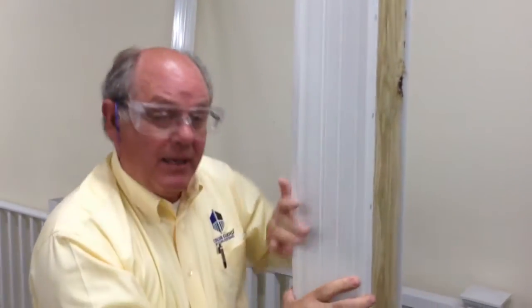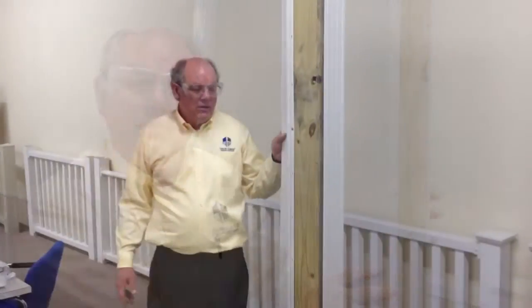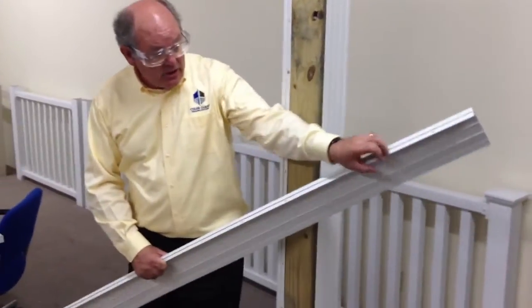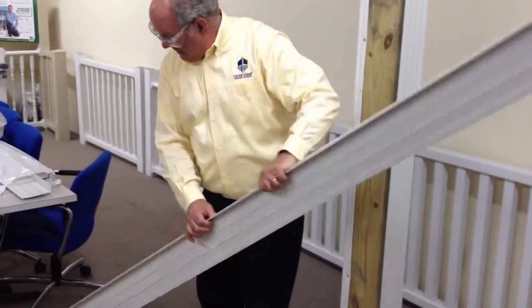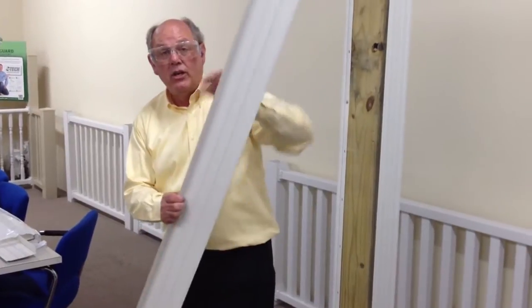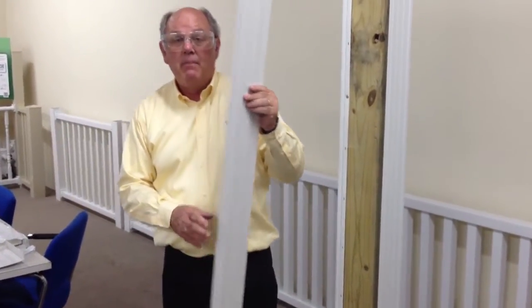You're ready to begin fastening with the nails. When you get to your last piece to install, all the fasteners on this product are hidden, so you won't see any nails and you can't put any nails in. As this last piece snaps on, it will be a nice snug fit, but it is a good idea to ensure that it stays on — just take a little bead of silicone in two or three spots along this edge to secure it once it's up.